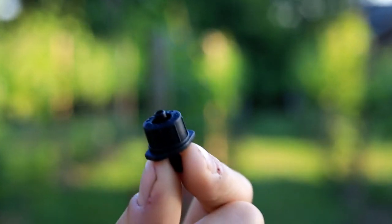I'll also mention that if your only goal is irrigation on a vineyard like this, you're probably actually going to want to use little drippers. The reason is you don't necessarily want to wet the leaves unnecessarily, because that just means more mildews and things you're going to have to fight. Normally you'll just put a dripper on each vine and selectively wet the root area. The only real disadvantage is it's going to be a narrower pattern, whereas the micro sprinkler overhead system is going to pretty evenly wet the ground.